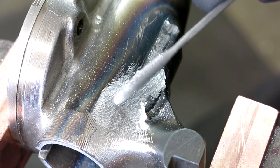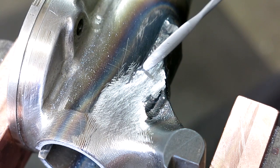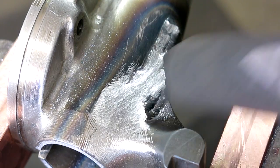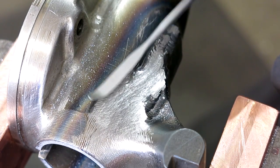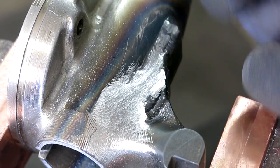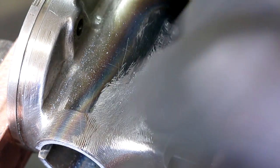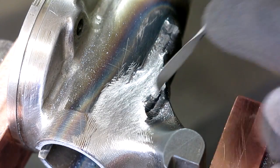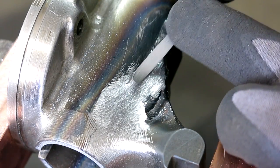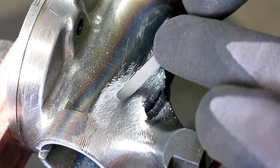This is a critical area to blend here — the transition from this material into this round. If you end up with a hard edge there it's just going to show through the paint. You want a nice transition, tangent to all these surfaces. That's why it takes a while with a little dorky tool like this. When you see die makers, their thumbs look like they've been stepped on by trucks — they're used to pushing with their thumbs and fingers so hard, polishing dies and things like that.